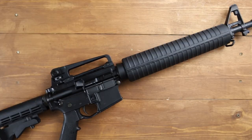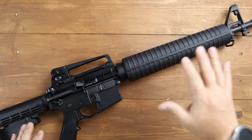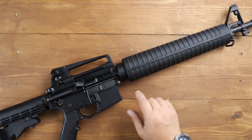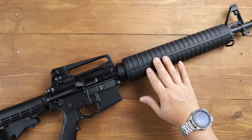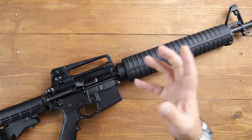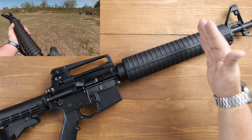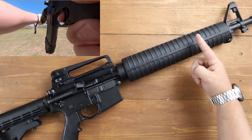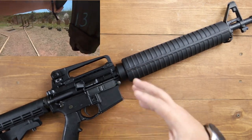So what is a dissipator upper? What makes this unique other than obviously the retro look? A dissipator upper was an attempt at making a carbine-length rifle using the rifle-length gas system and sight radius between the fixed front sights. It had some problems — they learned that the dwell times with the gas and the bullet in the barrel, and bleeding those gases off, caused some functioning issues. The way they alleviated that was by using mid-length gas blocks. They used a low-profile gas block and pulled the gas back from the front sight post back to the mid-length position to get more reliable cycling of the rifle.